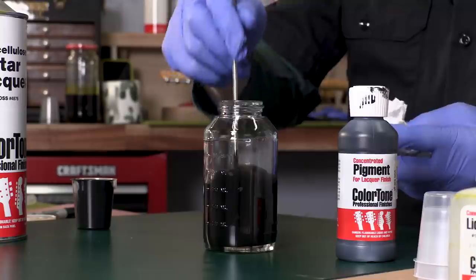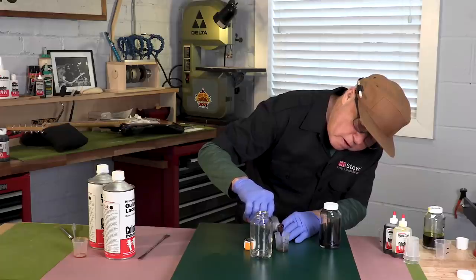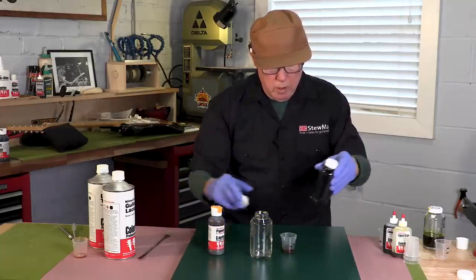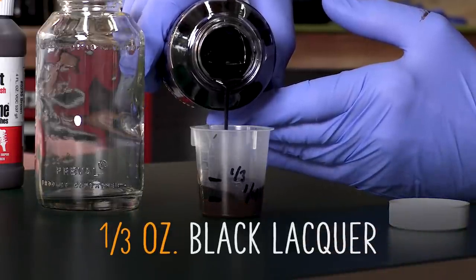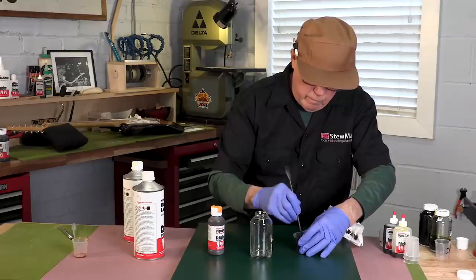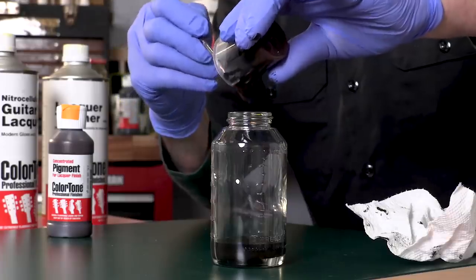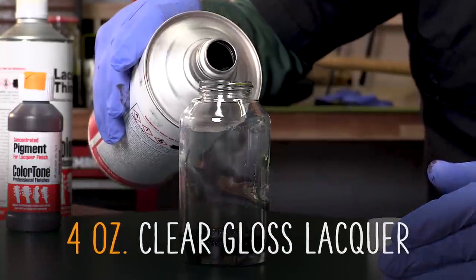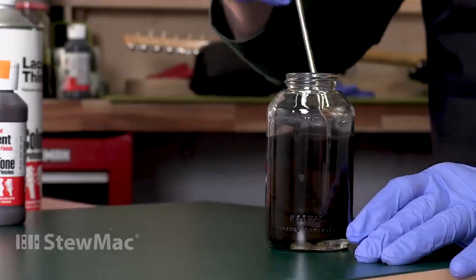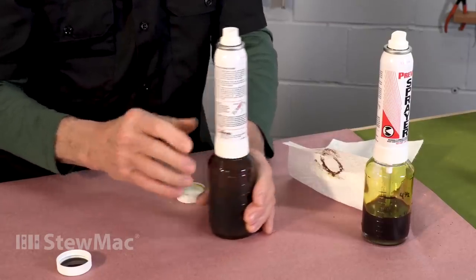There's black lacquer. Now we can make our brown shader, Salem Maple. For the Salem shader I'm using brown pigmented stain — I need a quarter ounce. It's like melted chocolate. To that I'm going to add a third of an ounce of the black lacquer that we made. That's not like adding black pigment — that would be way too strong. This is thinned down; it'll add black but not as strong as a pigmented concentrate. This is going to need a little bit of lacquer thinner just to thin it out a bit. Now we want four ounces of lacquer, going right up to the five ounce mark. This is ready-to-spray lacquer so it's already got thinner in it. Brownish black — it's just the perfect tone. And now we're ready to sunburst. Dark Salem Maple.